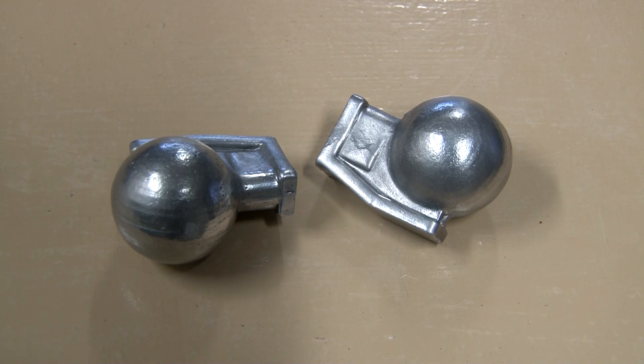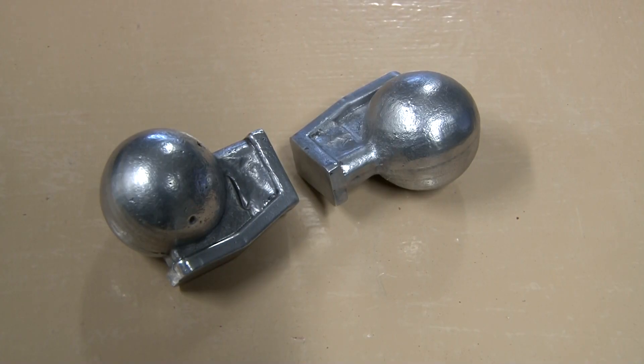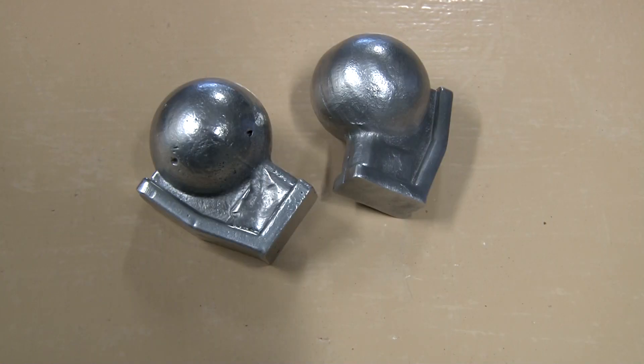Here's the review of the casting and tools. The grenades look pretty good — this is the side that turned out better. The flashing on the end of the handle came off just fine. Flipping these over — the part underneath the handle, called the fuse, caved in a little bit. I think the roundness of the grenade meant a large piece of aluminum was pulling in as it cooled, causing tension. There's also some pitting — not sure if it's from sand or from dumping the aluminum in and swirling up air. That's why you'd use a pouring basin and sprue for a normal casting rather than just dumping through the top of a flask.